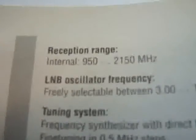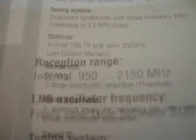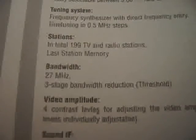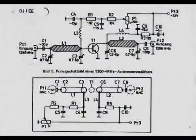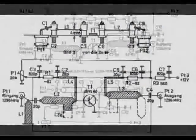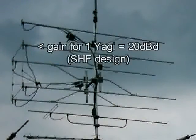The analog satellite receiver makes it easy to receive ATV. The frequency range of these receivers is normally between 900 and a little more than 2000 MHz — just enough to receive 23 cm in FM and the usual TV norm. Mount a low noise pre-amplifier as near as possible to the antenna. A Yagi antenna with about 20 dB gain above the roof will produce a good signal.